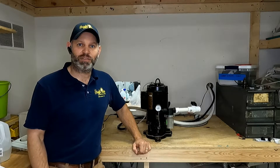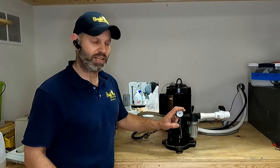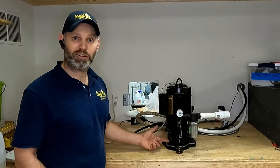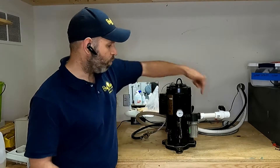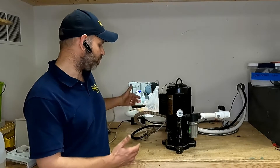Hi, it's Jason from the Dental Equipment Repair Channel. Today we want to look at a vacuum pump that we recently rebuilt — the performance isn't quite what we were hoping for, and I think I've discovered why. The vacuum on a wet ring vacuum pump should be around 10 to 12 inches of mercury. This type of pump operates by injecting water into an impeller housing, spinning an impeller very fast, creating suction on one side, and discharging exhaust on the other side.